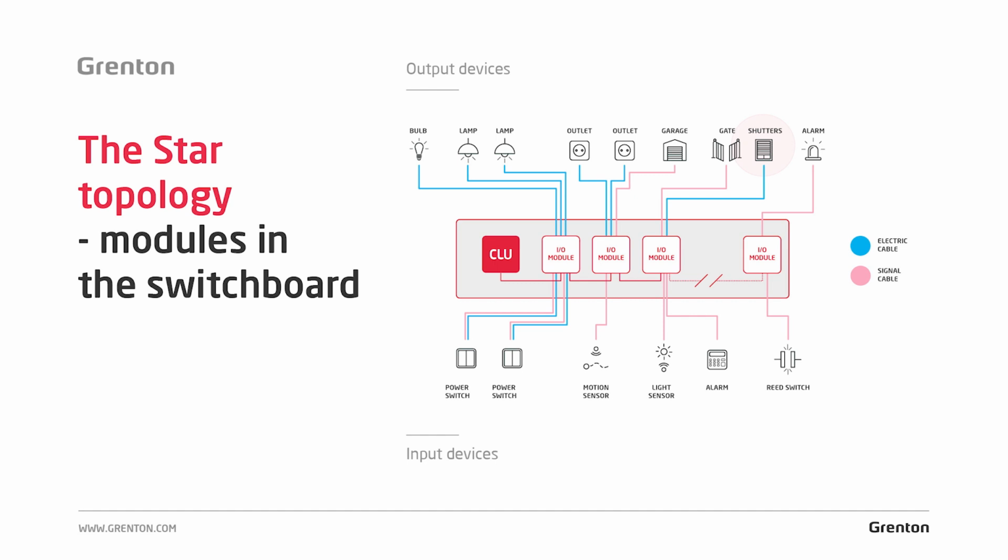In the case of roller blinds, we have two options here. There are two types of engines on the market, 230 volt AC motors and 12 or 24 volt DC motors. If at the construction stage we do not know yet what motor the blinds will be equipped with, it's best to arrange a typically electrical cable in this case.